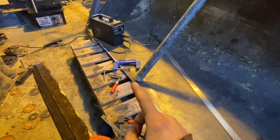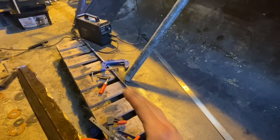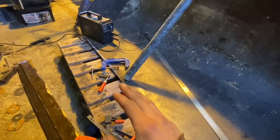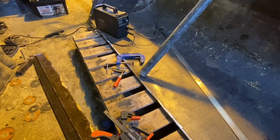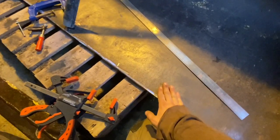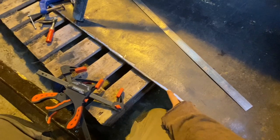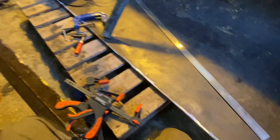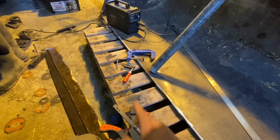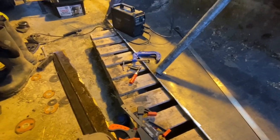I'm planning to start from the centre and work outward, so if I do need to change anything or it warps I can at least try and figure it out by the end. Then try and get some of these bumps out as well. This edge here is actually flat, or near enough flat for my liking — it's just a little bit behind it where it raises up. So I'll try and G-clamp it and pull it back in again and make the job good.